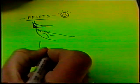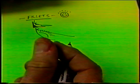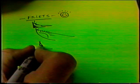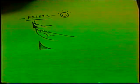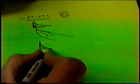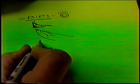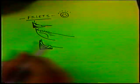On the Sidewinder, and I'll just try to go back, Sidewinder and Griffin, just to name two, had Tsunami. Carved wood fillets seem to work real nice. The only problem I had, and this is with Tsunami, is I never got a nice joint right here. I always had to put a little bit of that dap in there, and what I had was the fillet stayed nice, and I got a bubble over the dap.